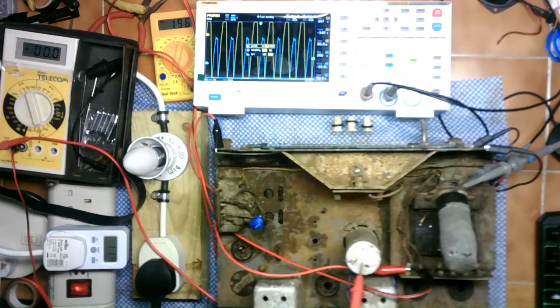So these would have to be changed at least. And I do have two, so I could, in principle, put a couple of 400 volt caps in replacement to replace these two, and actually then see again, but it's getting on kind of late. So I'll have a think about what I want to do.